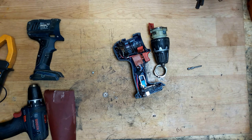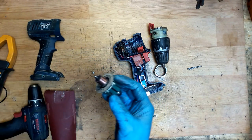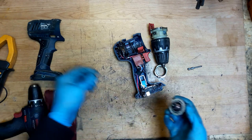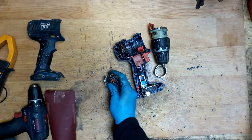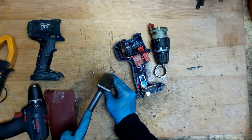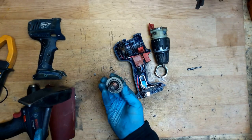So we now have a shiny commutator. One of the ways to reinstall the ball bearing — very simple — just put it on the table and hit the armature shaft back through.